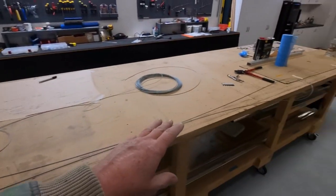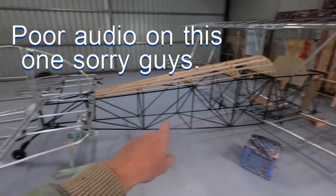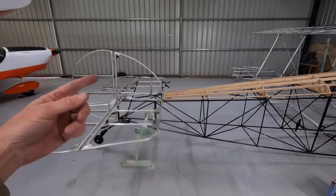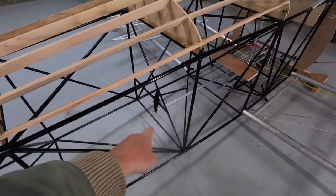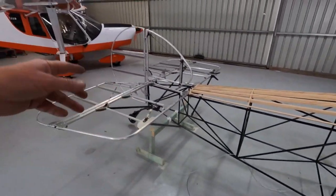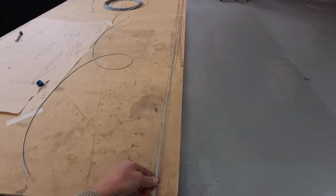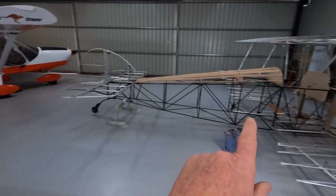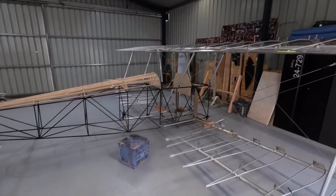So I've laid out and marked out my measurements. I've measured from the bell crank to the control horn of the elevator. I've doubled it, added a foot. I've done one cable down here — it's one continual cable with a splice or a crimp. It's going to be my down cable, and I've just cut the up cable on my bench here.